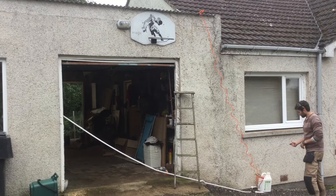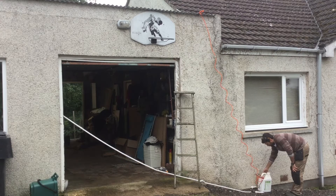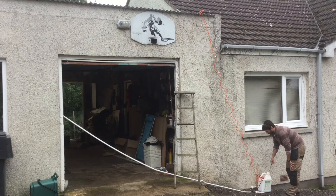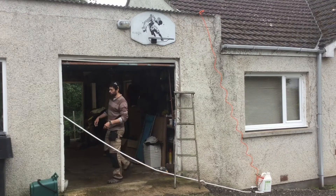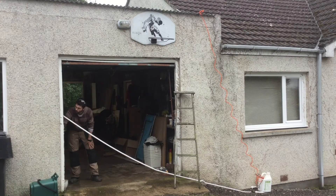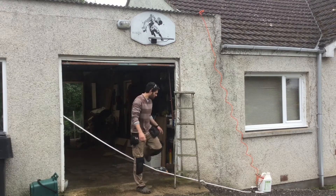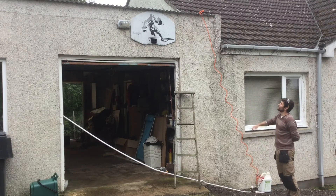At this point all I've done is wound the nut in until it's just touching the ball bearing enough. We've got it tapping away. We'll start to notice the water level rise slightly in the bottle as it starts to compress the air in there. As water moves up to fill that void the pump may well cut out — don't worry about it, just restart it. In this early stage of pressurising everything, I'm going to reduce the flow slightly — just turning the tap off so there's just enough water running in, only to stop my garage ending up as a swimming pool. It's tapping away — and there we go, water coming out of the top already, fantastic!